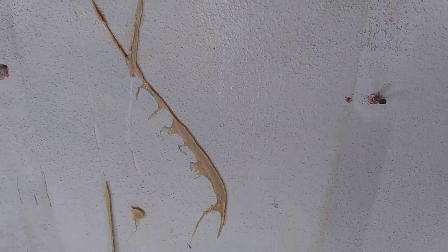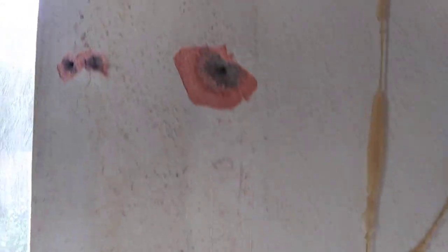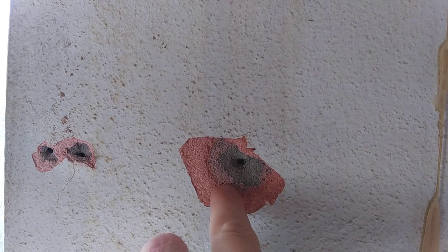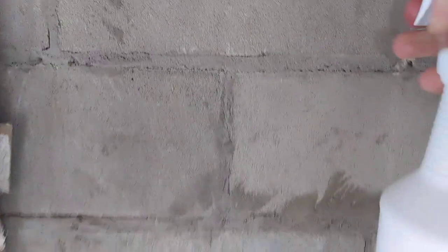When you spray a wall with water and you see water dripping down this fast — this is plastic. This is very much so plastic. Now look at this part here — see this pink thing? It's actually soaking it in. There's a big difference. Now I'm going to show you what happens when you spray concrete block with water. This is 1940s block — it will take moisture in and eventually release it out. That's how you know if you have lime wash or acrylic paint on your house.